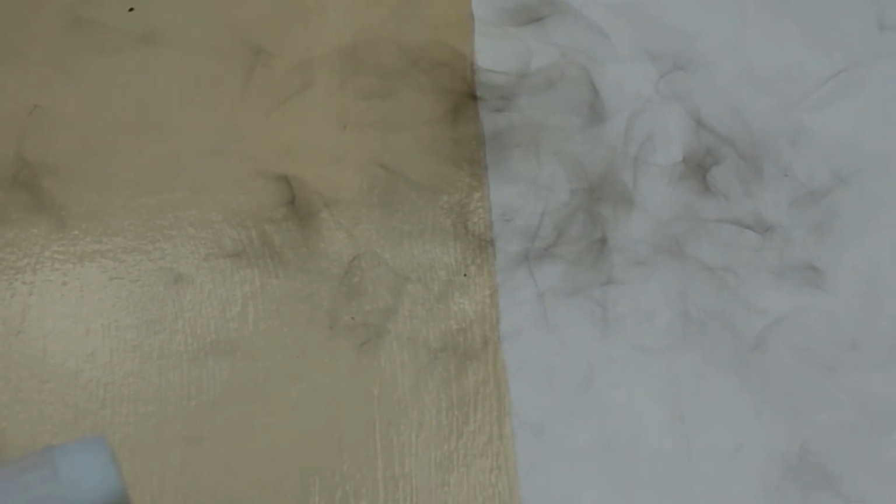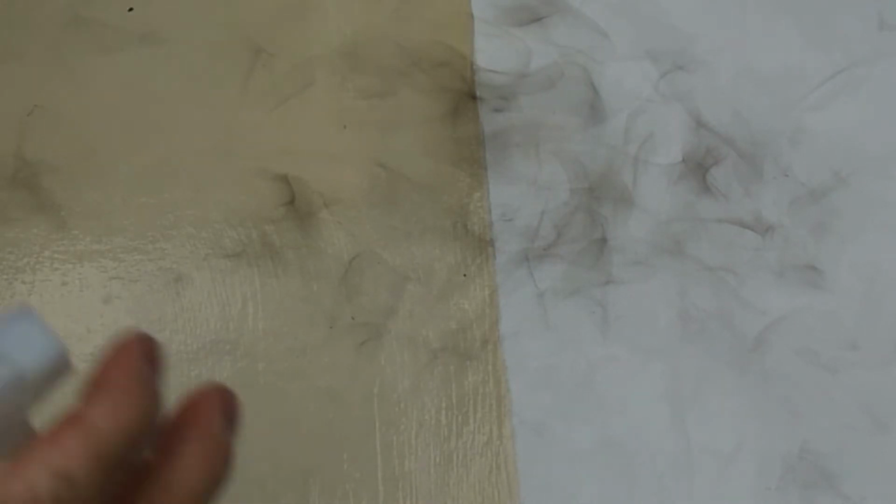This video is about wet cleaning on smoke damage. The left side is a semi-gloss paint. You can use a wet cleaning solution on this. Basically, I'm just using a spray bottle with Pine Sol in it. You spray it, just wipe it, it'll come right off in most cases, unless it's actually burnt in, then you might have a different problem. But other than that, it should wipe off.